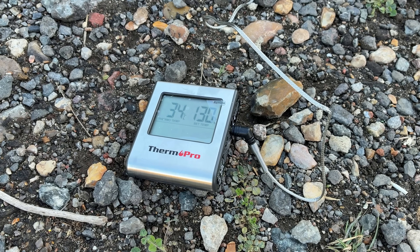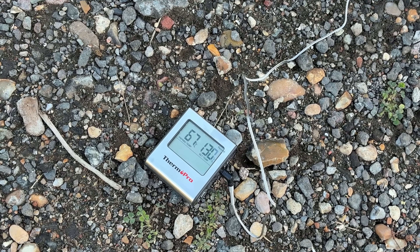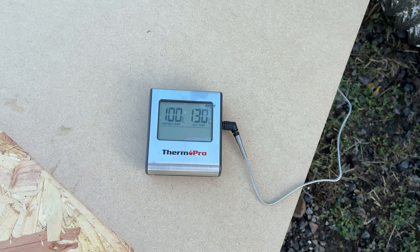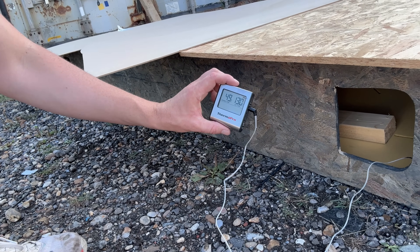20 degrees to get us started, and I did try to balance not opening the roof too often with checking I'm not killing our valuable core foam. 30, 40, still checking. About a minute later the rate of heating is consistent, so I'm optimistic — this is the exit port temperature. I thought I'd try and see how we're doing near the entrance, and yes, I have ordered a second thermometer. The temperature probe re-warmed back from being in the fresh air, and up we go again. It got into three figures, but then stalled — no further. I couldn't get it really past 100 at the heater end, and couldn't really get it past about 70 to 75 at the exit end. These aren't properly insulated top panels — they're just loose-fitting MDF. I was just seeing if I could give it a crack today.